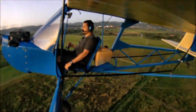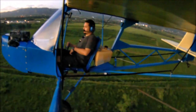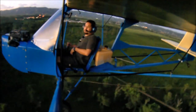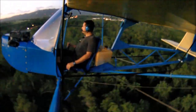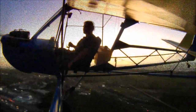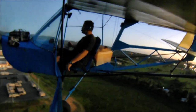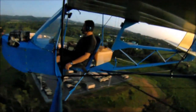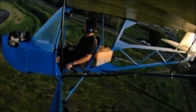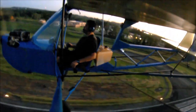Looking at the airplane itself — are you using a standard stick and rudder control system? Pretty much. It's a unique control system with a torque tube running from the stick underneath the seat with a bell crank. The bell crank runs up with turnbuckles — or you could use push rods — up to the fittings on the ailerons to actuate them. It's simple, light, and really solid in the air. For the elevator, it can be either cable or tube. The tube weighs a lot so we'll likely go back to cables with a pulley system, which works just as well and is much lighter.